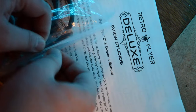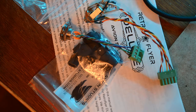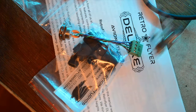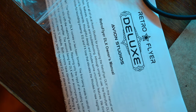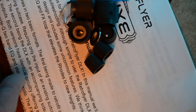So far the components look really well made. The faceplate catches elements of the original design and it should look at home on the front of a Fender Rhodes piano. We've got a nice selection of connectors and wires that are all pre-assembled — this looks like it's going to be quite an easy install. The jacks look to be of good quality; these look like they've got a chance of lasting another 50 years. The RCA jack looks really nice, gold plated, so it's not going to corrode. It's going to be a low resistance connection and this alone is going to be much better than the standard RCA jack on many pianos.